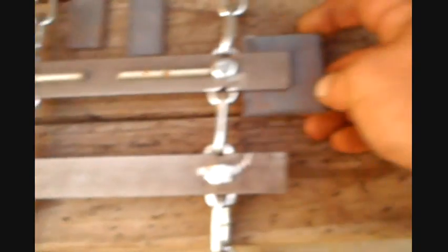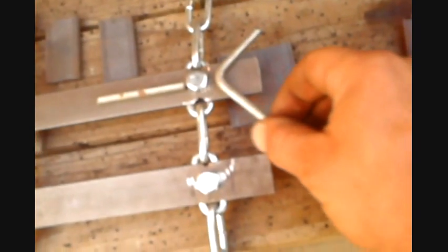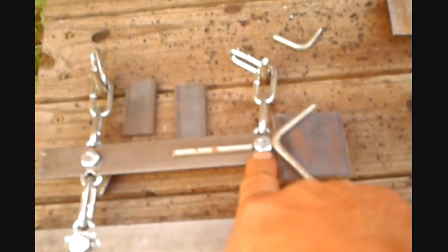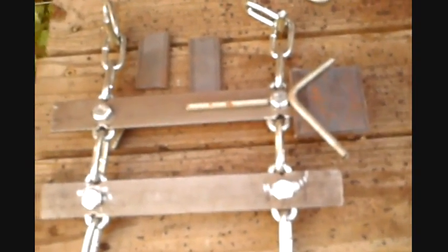When these are on here, these will pretty much extend out as a V. They'll be welded to the center bolt too, and they'll come out and over to make half a diamond. That's how the cleats are going to be — pretty aggressive design for the cleats, but I don't have any other way to do it. I've got to use cleats to compensate for spacing for the bolt. I don't want just the bolts riding on the ground; I want the cleats riding on the ground too. It'll take a while for the cleats and the bolt head to wear off to where you have to rebuild the track plate.